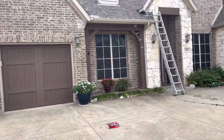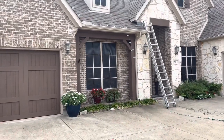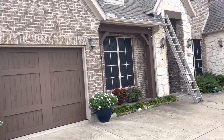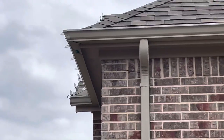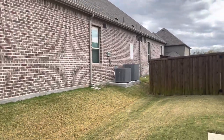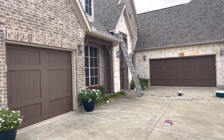Right now I'm about to run the power. We're going to go from the outlet on the left side of the door, up this gutter. I'm going to zip tie them — that way the extension cord is hidden so your setup doesn't look hacked out like the previous install. He's got a cord going three feet over, showing everywhere, ran 50 feet to the side. This is what happens when you hire a landscaping company. It's going to be nice, flush, and hidden.